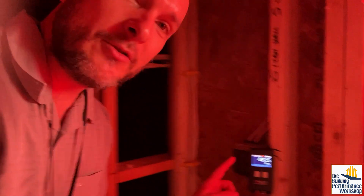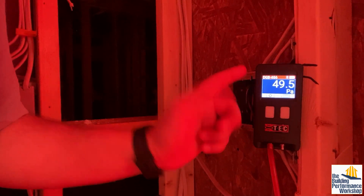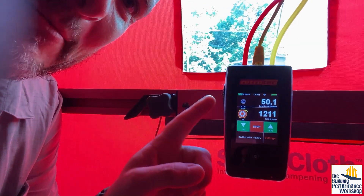There's probably just one hole left — probably in the hottest, most uncomfortable place in the entire house, so let's see if we can find it. The house next door is at 49.5 pascals — we'll call it 49.6 — with a 0.4 baseline, so it's a pure 50 next door. That house has no connection at all with this one, which is good because now we don't have to worry about things like if somebody starts cooking in there, those smells won't be an issue over here.